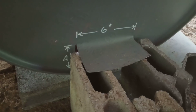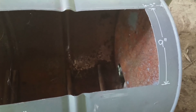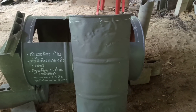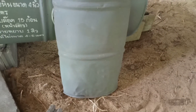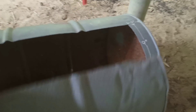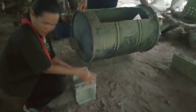After we cut three holes in the first drum: the first big hole is the door where we fill up the firewood, the front hole is where we start the fire, and the back hole is the chimney. For the second drum, we cut a lid about 17 centimeters wide, the full length of the drum — or bigger is okay — just to make sure it can cover the door where we fill up the wood. We need to use this part to cover it and seal with mud and sand later.